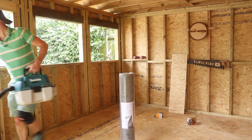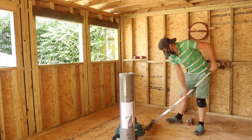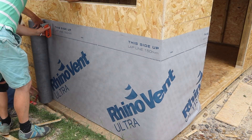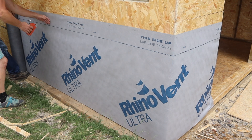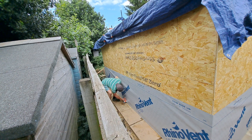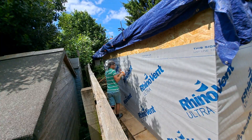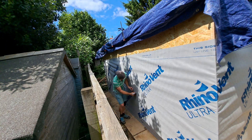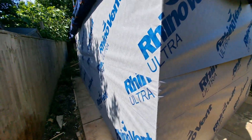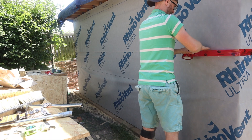It's a bit of a weird moment - I suddenly had the urge to clean and decided to remove all the dust, thinking that if I wrapped the building I'd never get in here again to do it. As for the wrap, for the first time in many of these videos I've actually got a helper with me who refused to be on the video. One person pulls it tight, the other one just staples - I don't think there's a rule for how many staples you need. Just hold it tight to the building, don't go mad with them, and then overlap to the line on the wrap. Once it's wrapped, you just need to tape up the joints.